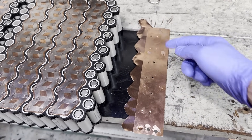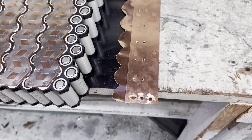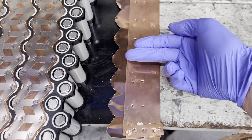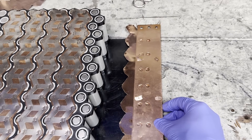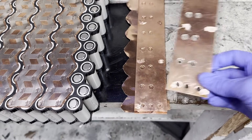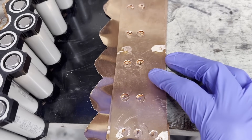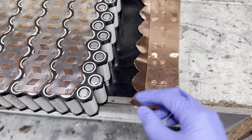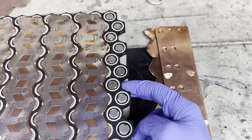Now remember, I want the current to flow from the top to the bottom and back up, so I'm going to put a spacer at the bottom and then some insulation so the two sides don't touch. After that, I'm going to put two more layers of 0.5mm copper — this time with bigger holes around where the bolts go so the bolts don't connect. I've made sure to space everything out so I'm only putting the bolts in the gaps between the cells, so I don't hurt any of the cells.